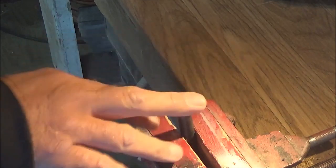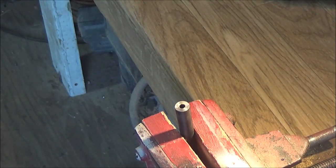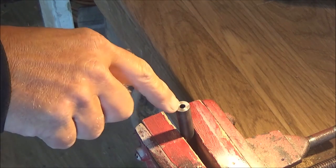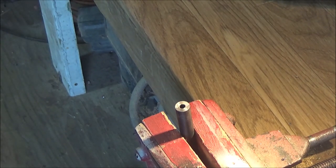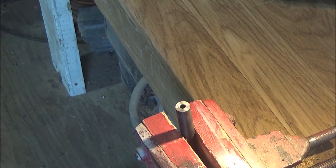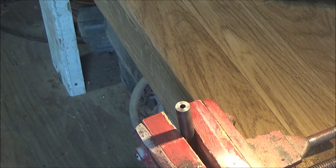Now, you're supposed to have a polishing compound of some sort, something that's a little gritty. Now, because our barrel is a scrap barrel, we're not going to go through all the little procedures of jamming a Q-tip down there, but you'd want to jam a Q-tip or something in the hole if you're leaving the barrel in the gun. If you're taking it out, then don't worry about it. Just spray it out with automotive brake cleaner after you're finished, and that'll take all the debris out.